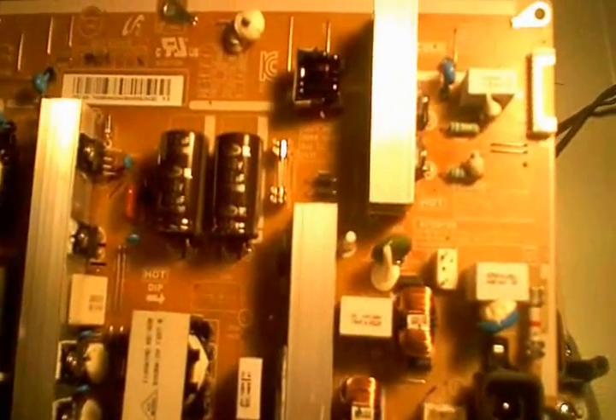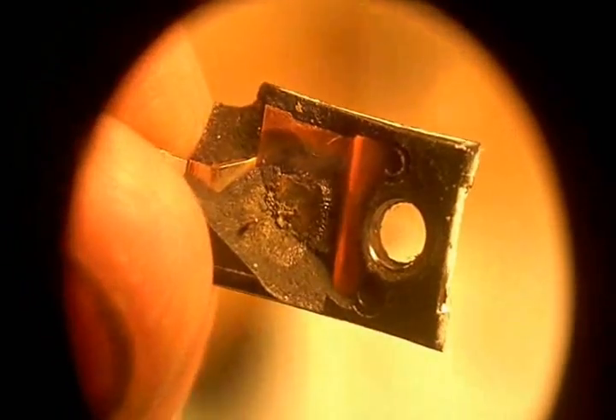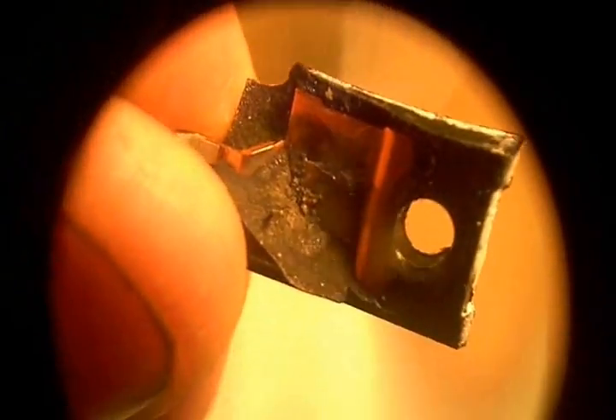Unfortunately you run into a lot of difficult situations like I did with this one. I had a problem with a couple of bad MOSFETs on this heat sink here. One of them I didn't even need my meter to see there was an issue — if you hold a magnifying glass here you can see the way it pretty much cracked when it overheated. Not much left there. So it was a no-brainer to know I needed to replace a couple MOSFETs, but the problem was that on the backside of the MOSFETs, what appeared to be the driver transistors — I wasn't able to identify what they were.